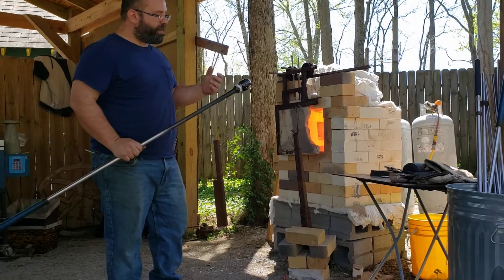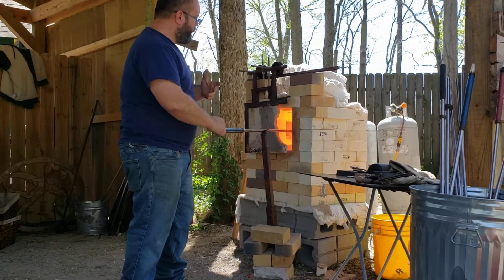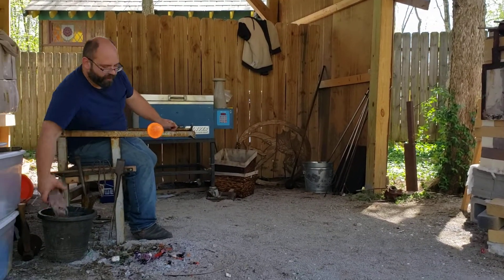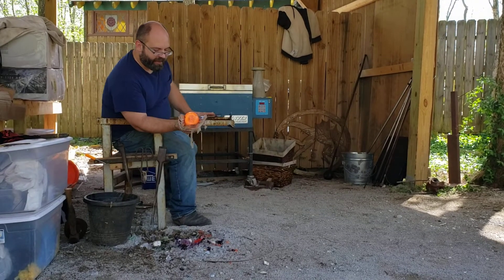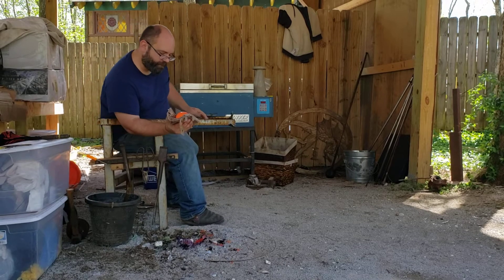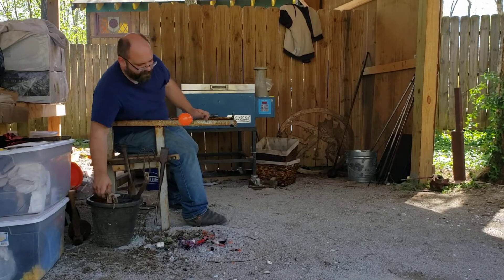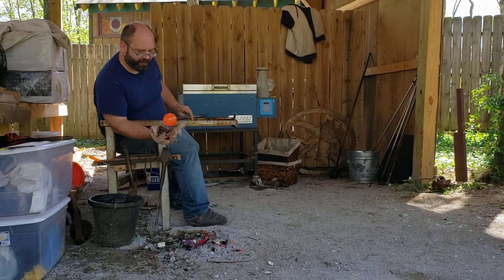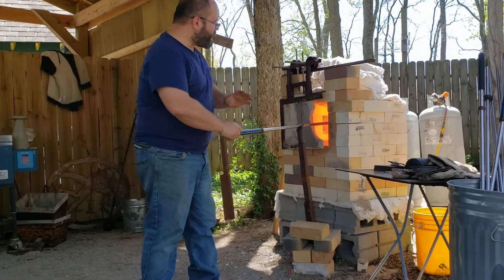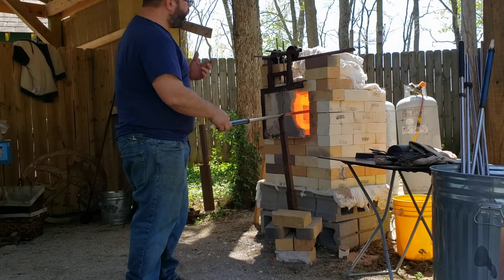So I'm going to go back in the furnace, scoop up another layer of glass, and start shaping this up with my favorite tool. This next step, a lot of people do differently. Some people like to use the marver, some use a wooden shaping block, and some people, like myself, prefer paper — ordinary paper that has been soaked in water. That lets you grab the glass and squeeze it into shape. There's not a right or wrong way to do this — it's just personal preference. I prefer the paper because it will conform to whatever shape my hand tells it to. Any time you're shaping the glass with a wet tool, especially paper, you are cooling it down extra fast, so go back into the furnace and let the heat soak back into it, getting the whole thing moving and that heat back down into the core.